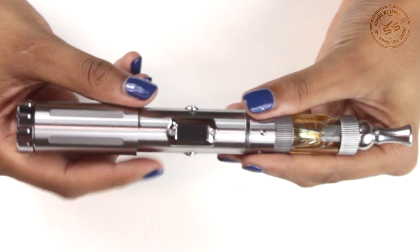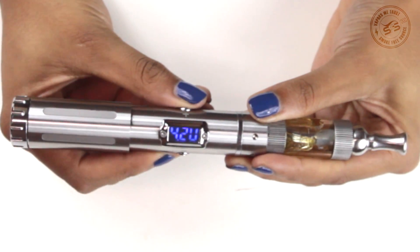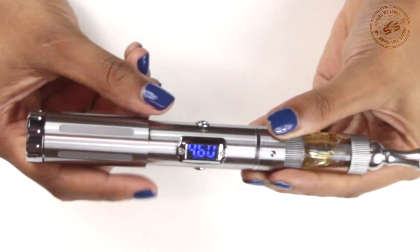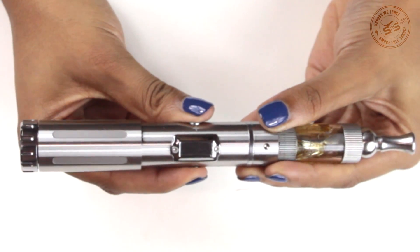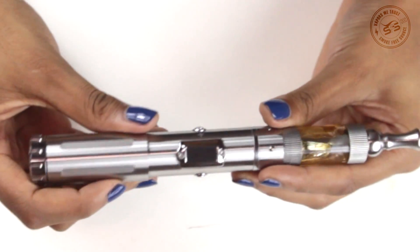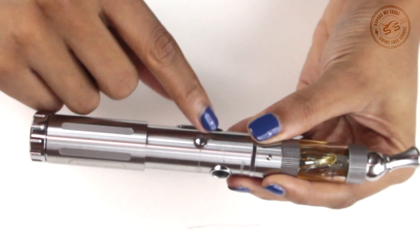You have to keep holding the buttons down until another screen appears, which will be either voltage or power setting. Once successfully unlocked, it will remain that way unless you take out the battery. You can then change the voltage up or down. Should you wish to lock the unit, just repeat the process. If you keep pressing the plus button, eventually the setting will reach the highest level — 6 volts — and then round robin back to the lowest setting of 3 volts. The same goes for pressing the minus button, but in reverse order.